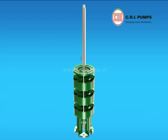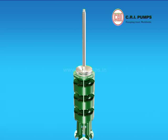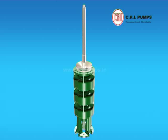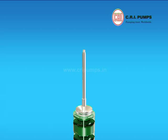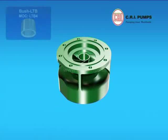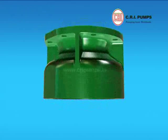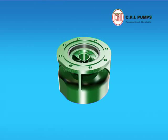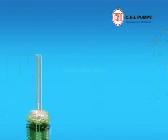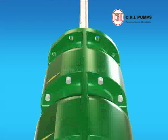Stage key is fixed to the pump shaft. The impeller is pushed through the shaft onto the third stage casing. Stage sleeve is pushed through the pump shaft onto the impeller. Gasket is placed onto the third stage casing and kept aside. Now the LTB bush is pressed with the help of hydraulic press onto the stage casing. Wear ring is pressed onto the stage casing. Studs are fitted onto the stage casing and tightened. Now the stage casing with LTB bush is placed onto the third stage casing and tightened with nuts.